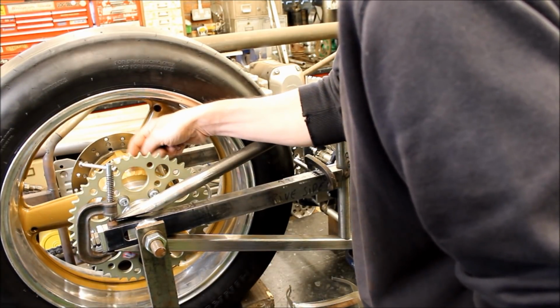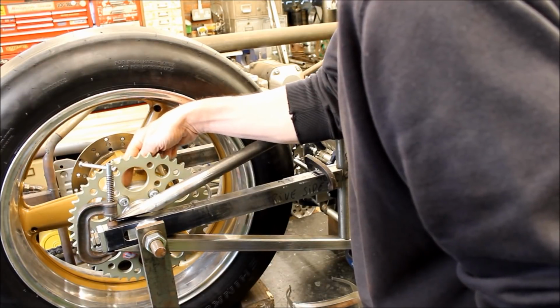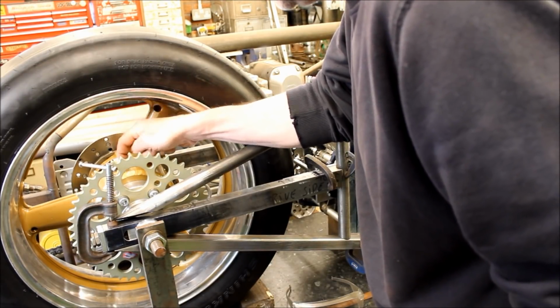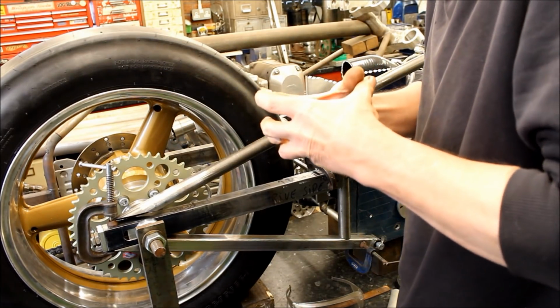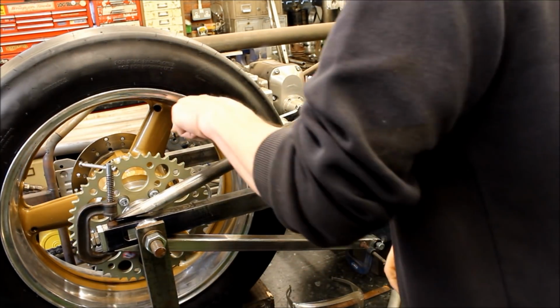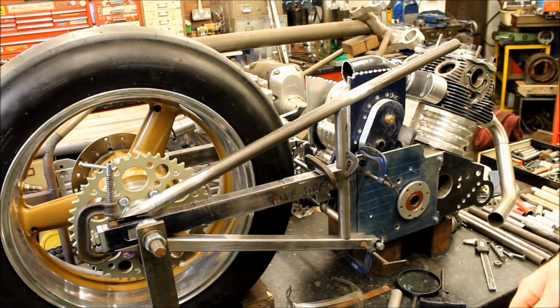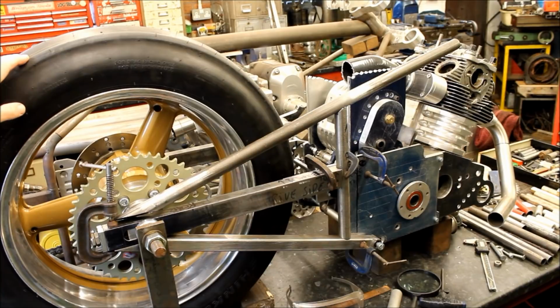When that was welded on, the casting of that, the thread, when we drilled it to thread for the sprocket, the bolts still do go through. All the way. So the weld isn't taking the full load. No, but even so, if it did, a weld round there on a 6-inch diameter, you'll break tyre traction, I think, before you shear that.